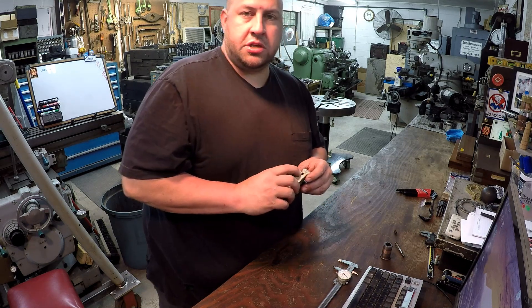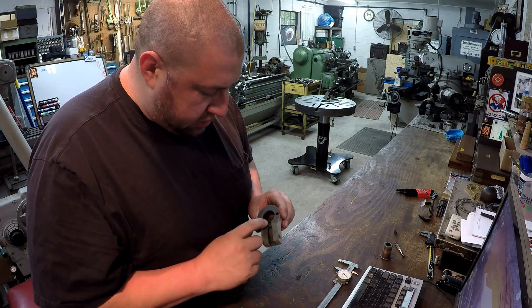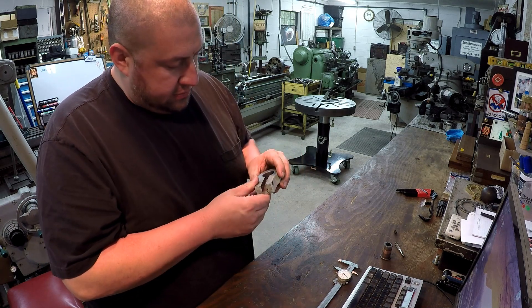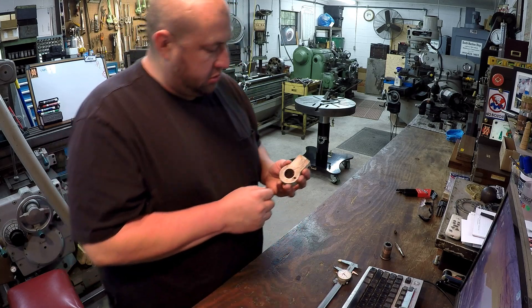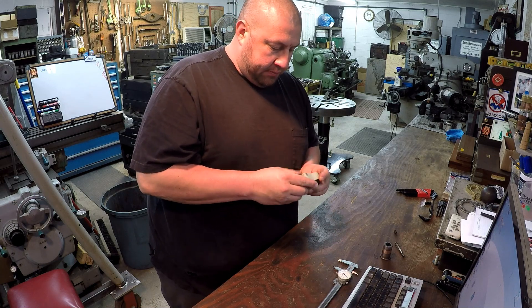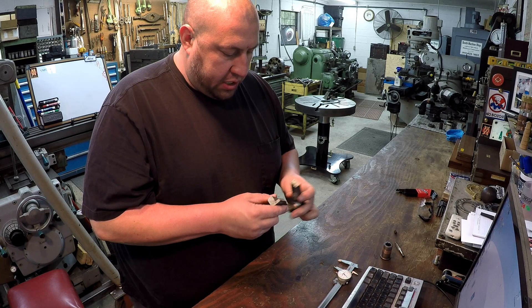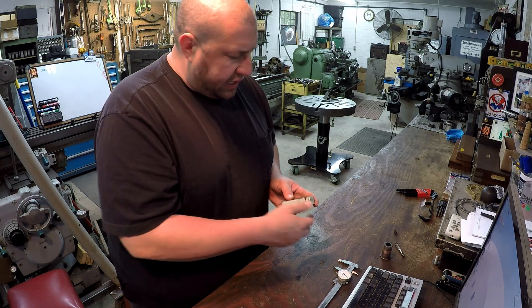We know we've got an 8mm set screw hole here. The slot right here, I believe it's 10mm, but it's a little oversized right there, but I think we'll be okay. What I want to do is bead blast it and get all this paint off, and we'll probably warm this one up just like we had to do the bushing. Make sure there's no oil impregnated in it.